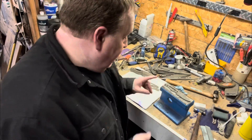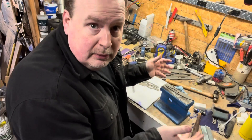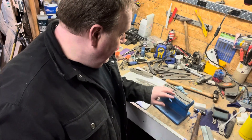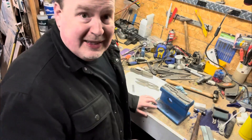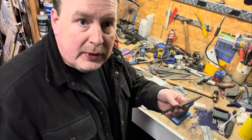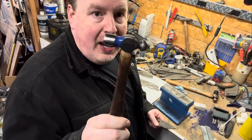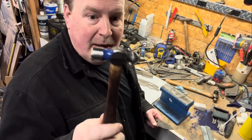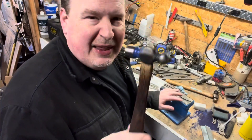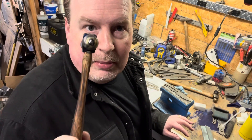The first counterintuitive thing is that you're putting the warp up. You would think you want it like this so you can pound it down — not how it works. I haven't dug into the science behind this yet; all I know is it's working. So you want the warp up. This blade is hardened to 62 or 63 Rockwell. This is a hammer from KH Daily Knives. I heard this on their podcast and saw a Blade Forums post, so I got it from him. It's about $125 and it's got a little carbide ball in it.